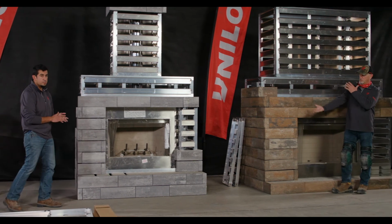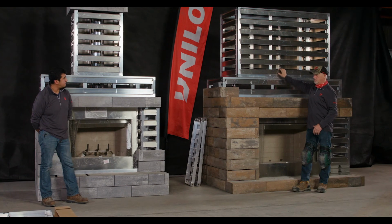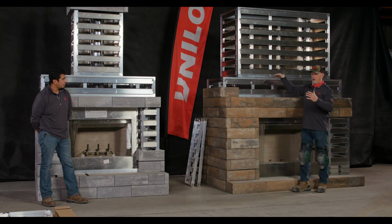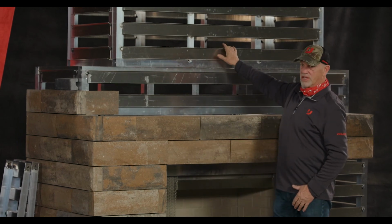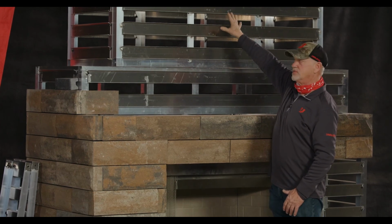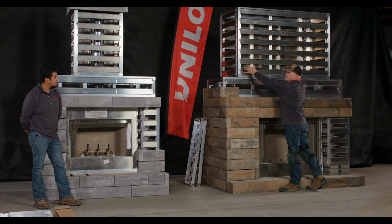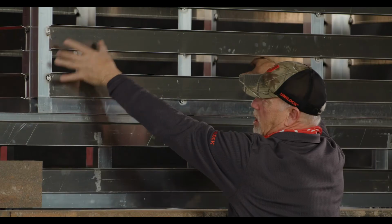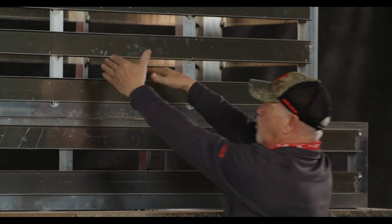Yeah, as we worked our way up, let's go backwards on this one, all right? Augie touched on it right here. We've been on a number of job sites where this is a focal feature at the end of perhaps a pavilion in that backyard application. So here we've got the larger cabinet that you could do a flat screen exterior TV mount onto. You've got enough distance away from the cavity to import both your projection cables as well as your power cables, away from your heat source.